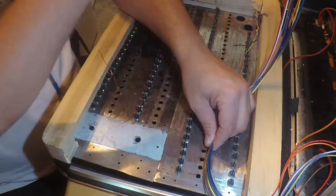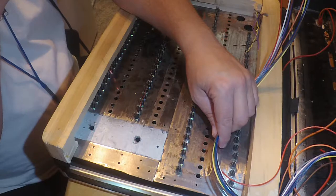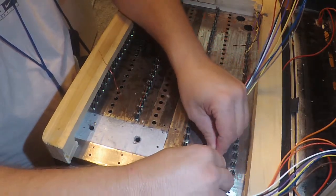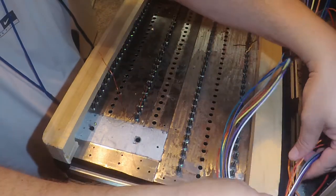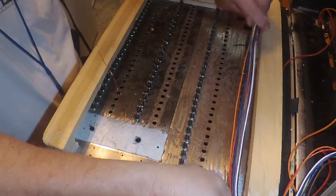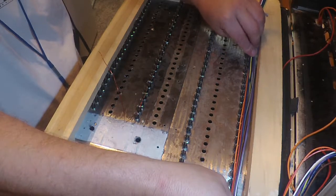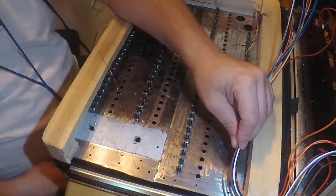And as you cut, you're going to lose that length of wire. So that's why I don't stretch it out and go, okay, I'm going to make a cut here and cut here. So that's why I'm doing it this way. That way I can correctly lengthen the cables. And then what I'll do is I'll use lacing string and put it all in a nice ordered fashion. My goal is just to lay it right like this. And then that way it will go out to the firing, down to the rails or slats or pods, depending on how I'm gonna do my show.